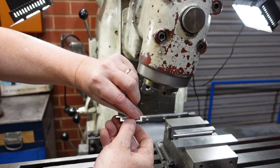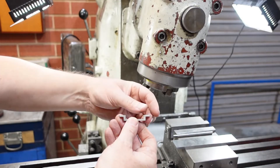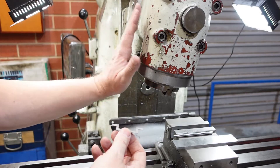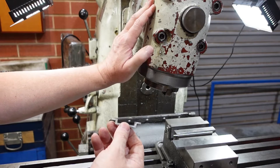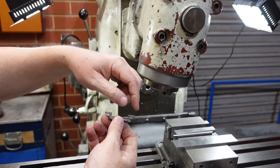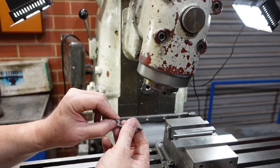What I'm now going to do is put a bit of an angle on there to give me a sort of uniform thickness, and that'll help with my heat treatment. I've actually canted the head over by around about 13 degrees, and I can then put a cutter in there and use that just to trim those out, flip that over and so on to get the angle right.